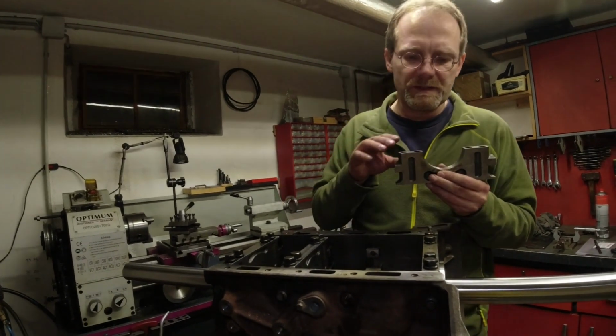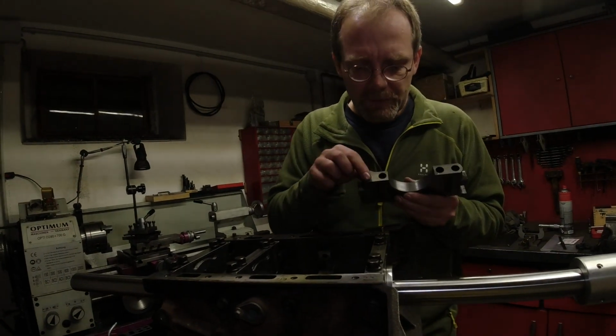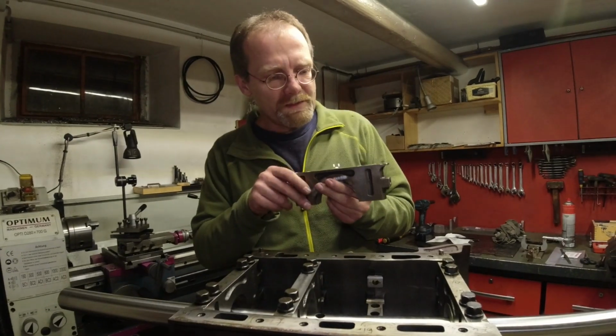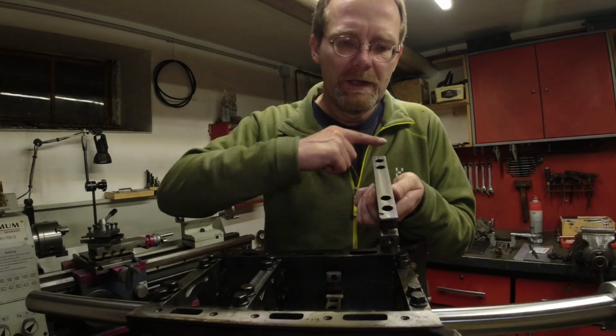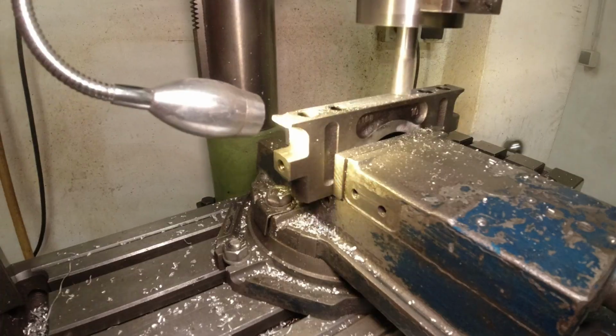Now, good machinists do this in a grinding machine, but I did it actually in my mill. So you can still see the milling trace marks here. The first step in order to machine this side off was to clean this side. That's why there is a cleaning cut on here, to get it nice and even, because it was bowed. Makes sense to everyone.